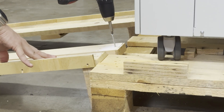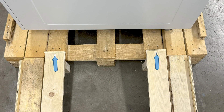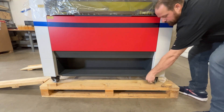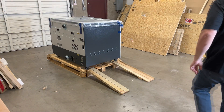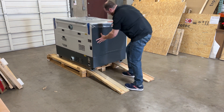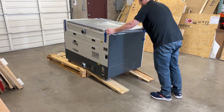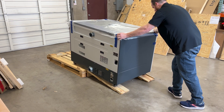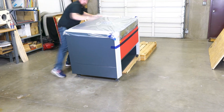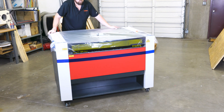The laser machine is now ready to be unloaded from the pallet. Unlock the two locked wheels at the front of the machine and ensure there is a clear path at the base of the ramps for the machine to be safely offloaded. Align the wheels properly before gently guiding the machine down the ramps — the force of gravity will assist in the descent. For optimal safety, it is advisable to have a person stationed on each side of the machine. While it is feasible to conduct this task solo, doing so significantly increases the risk, so it is strongly recommended to involve multiple individuals when possible.